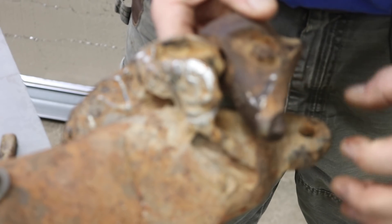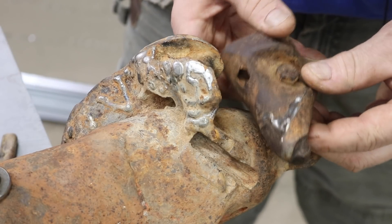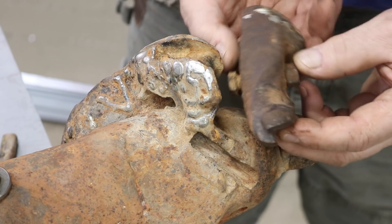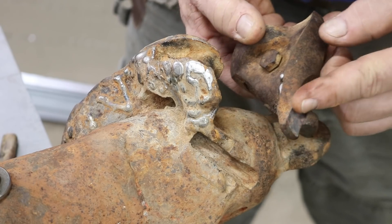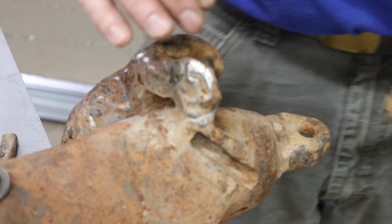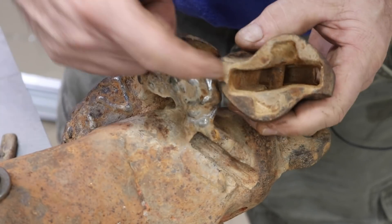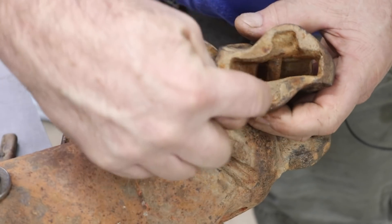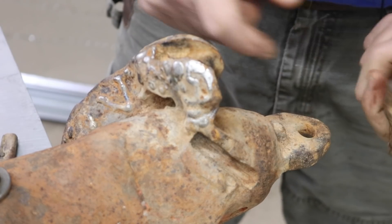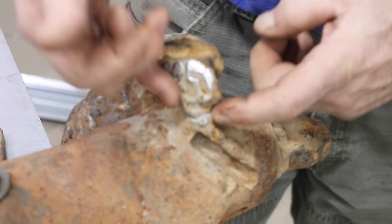Most tips are a lot longer and highly fluted to help grab into the ground a little bit, and it helps keep you centered when you're drilling the hole. We'll just grind this a little bit. If this all works out, we'll probably look for a tip that fits this configuration. You can see how it has a bar and then two dogs and a bolt hole that locks it on. So we're going to get going here and cut this away.